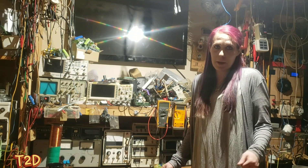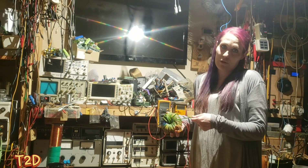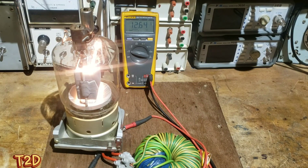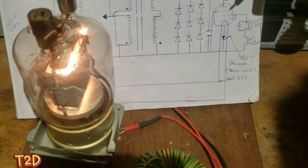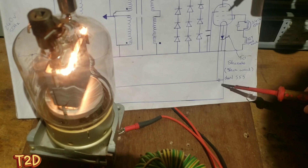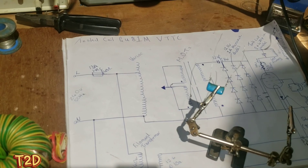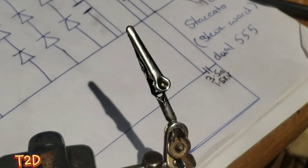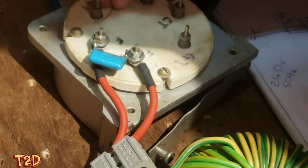There are many ways you can do this, but I've chosen to get a medium-size toroidal core and add turns/windings until I've gotten up to the desired voltage. As you can see, we've got this wired up and plugged in - we've got 240 volts on our primary and 12.6 volts required for our filament. From the schematic we need a low-value capacitor across the filament - we've found a suitable one at 3.5 nanofarad, 1.5 kV.